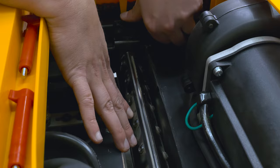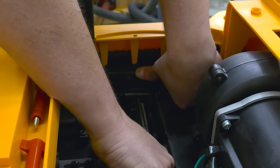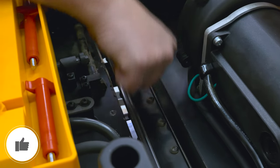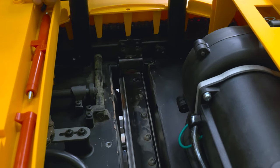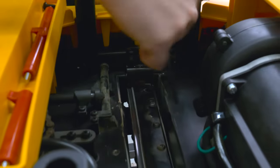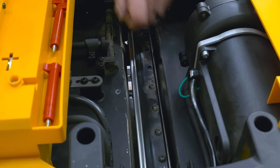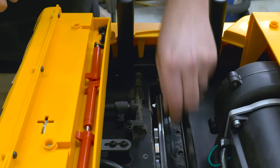There's going to be this little lock that latches up and down — in order to turn the blades, you're going to have to push down. Watch your fingers; the blades are very sharp and you don't want to cut yourself. To work on the blades, we're just going to take out all of the screws that hold the blade in place. I like to use this little tray at the top here just to hold all of my screws while I'm working to keep them organized.